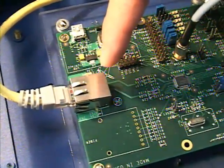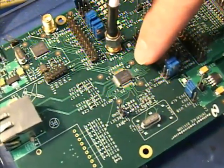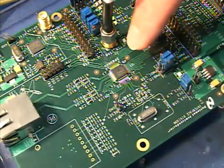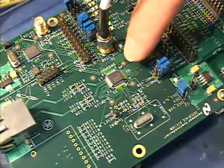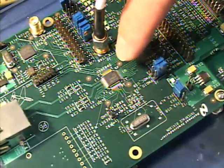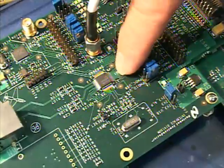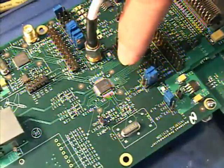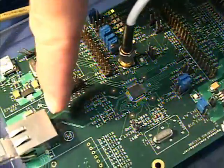Over here, the DP-83640 chip is on the IEEE 1588 slave. This chip is acting both as a standard Ethernet PHY and also as a very sophisticated IEEE 1588 time component. From the standpoint of the hardware, it looks exactly like a PHY, so you can easily add this into your existing systems with standard PHY connections — an RMII or MII interface to the MAC and the standard RJ45 connection.